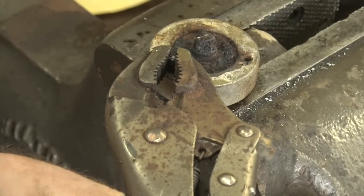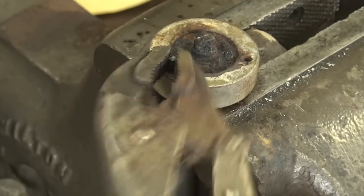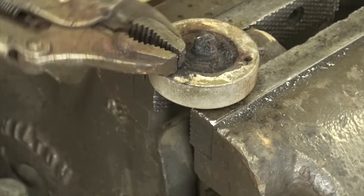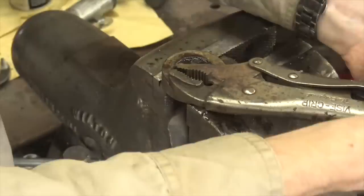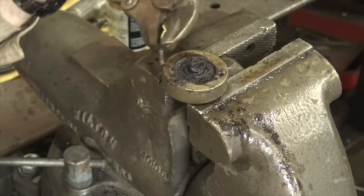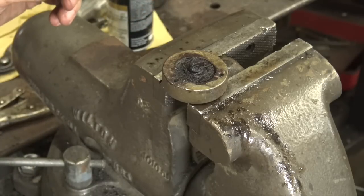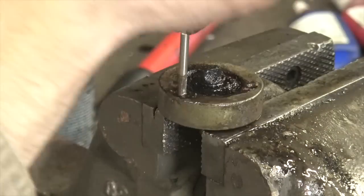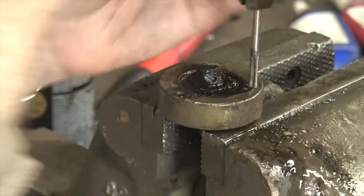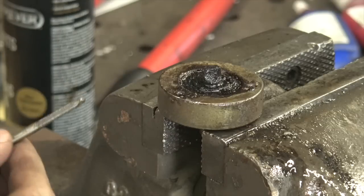Whoa — it's coming loose! It actually moved. Come on Vice Grips, release. Should put some of that penetrating oil on these old things. Hey, it's coming loose — let's do this. We got it out. What a blessing — I thought that was going to be a disaster. Some foamy tapping compound, and now we tap it out. Nice. Time to clean this up on the wire wheel a little bit and we'll take it from there. Now the really fun part is going to be getting this center section out. Hopefully it's not stuck too bad, so I'm just going to brass-hammer it here a little bit.